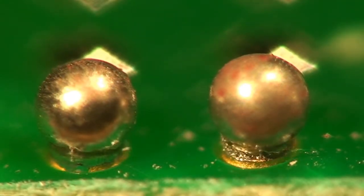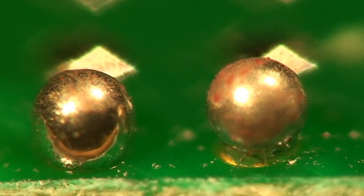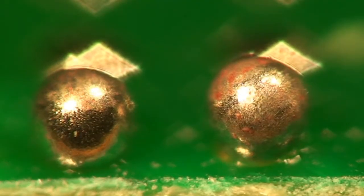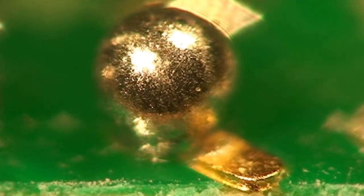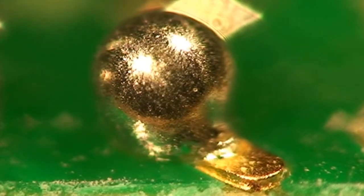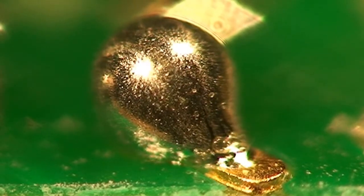What you're doing is modifying the pad subtly to allow the solder paste and the solder from the sphere on your package to wet out and change the shape slightly when viewed with x-ray inspection. This allows you to see for yourself with very simple x-ray equipment the wetting characteristics.